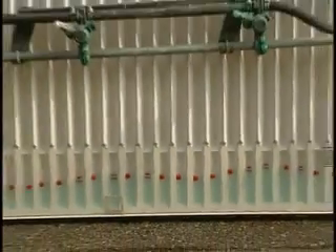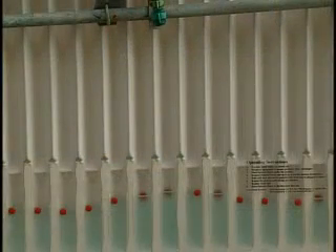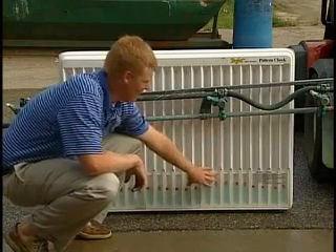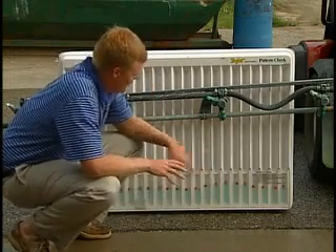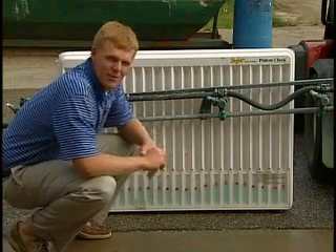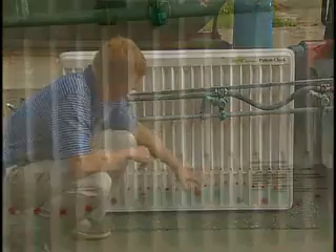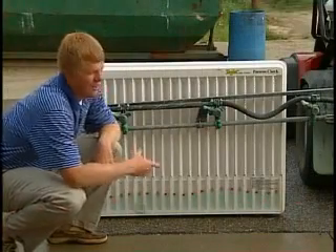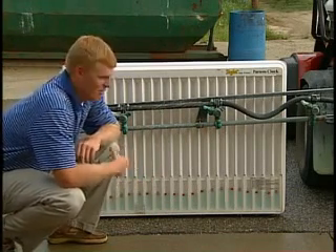What we're showing here is some nozzles that are showing some signs of wear. This is normal wear that you're typically going to see through a normal spraying season. You have peaks and valleys in the pattern, which what has happened is the nozzle is worn, so the spray angle has decreased, thus giving you more water underneath the nozzle and less water in the middle between two nozzles. This wear right here is pretty extensive, but when this is being filmed, we're three-quarters of the way through a spraying season. With new nozzles, you would see a perfect pattern where all the balls would be floating even. Now we would do the pattern check underneath each boom, trying to run the boom for approximately the same amount of time as we did on the first one to show how even the pattern wear should be.